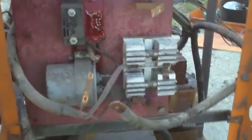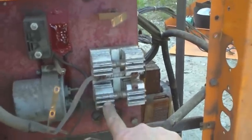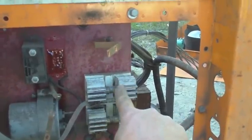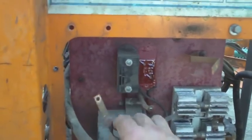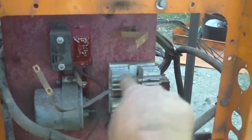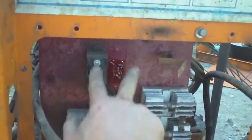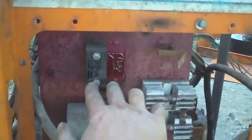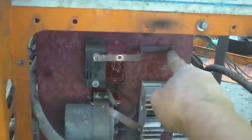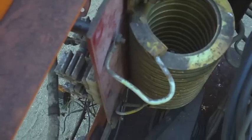Let's see if I can identify these positively on the schematic. I can see right here that there's a lug that comes up with a copper strap going into one of the spark gaps, then there's a copper strap that goes over to the other end of the other spark gap, and a copper strap that goes across the two capacitors. What that tells me is that the two spark gaps are in series and the two capacitors are in parallel, and the output of the two capacitors is in series with the two spark gaps.